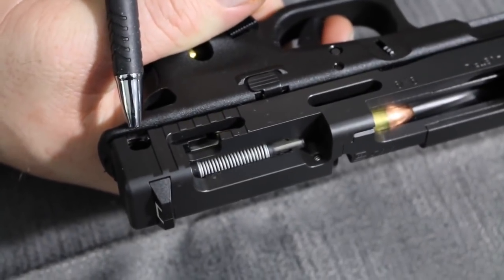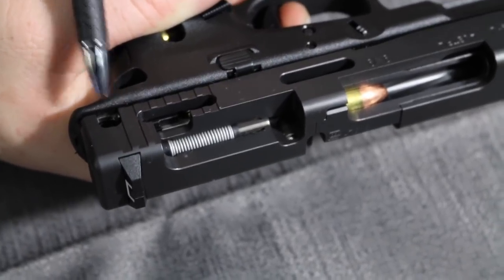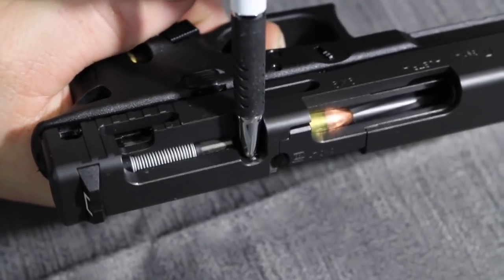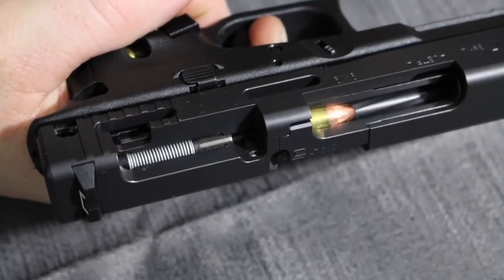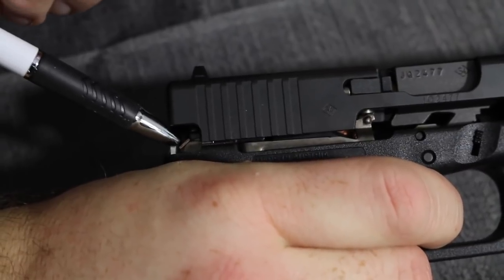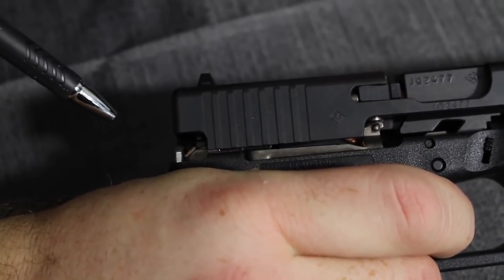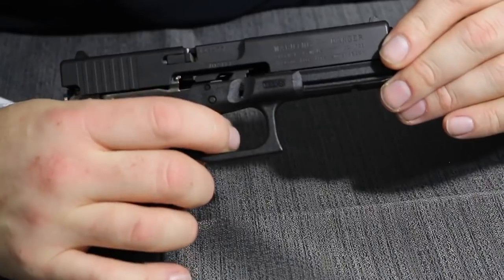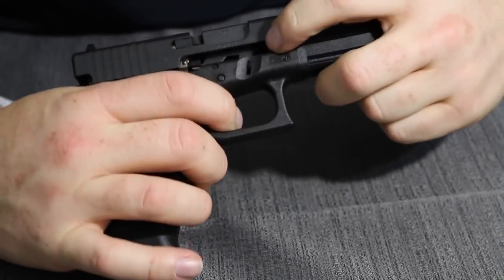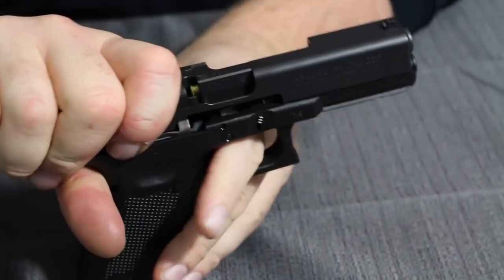Also, as we notice in the rear, as the trigger is pulled to the rear, we can see the striker and we can see the trigger bar pulling rearward on the striker. We get all the way to the rear — trigger safety disengaged, firing pin safety disengaged, trigger is pulled all the way to its rearmost position. Now it's the last moment before firing. As we pull downward on the connector, it releases the drop safety to fire. Once the projectile has left the barrel, we now unlock — we can see the location of the barrel and the locking block as it unlocks.